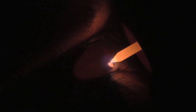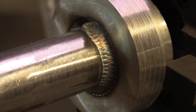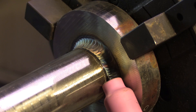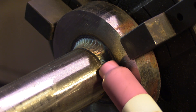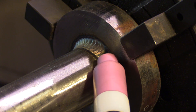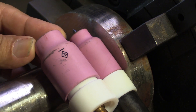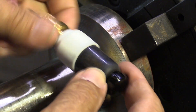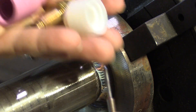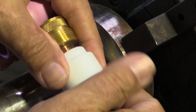Tapering off there — that's one pass over top of the first pass. Now I'm going to do one wide pass over top of that. You can see that in order to do that, this cup is kind of bumping on the wall with the large diameter part of the cup and it hits the jaw a little bit. So I'm going to go ahead and go up to the large diameter gas lens setup and go all the way up to a number 12 size cup — that's as big as I'm going to go today.